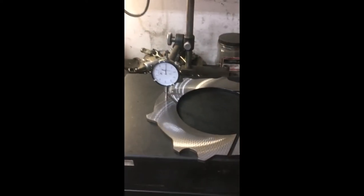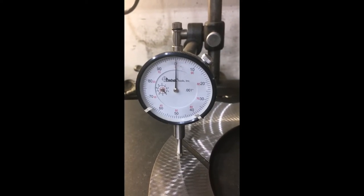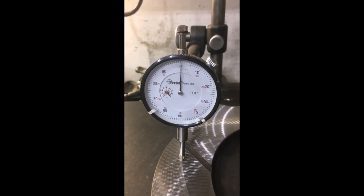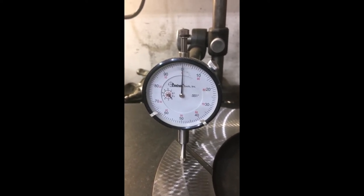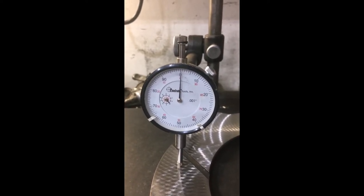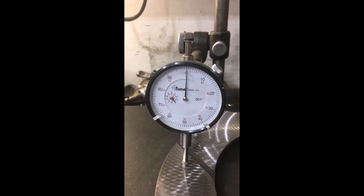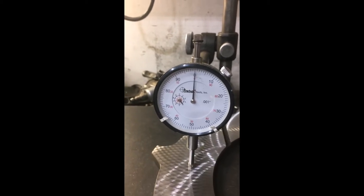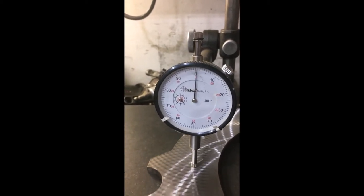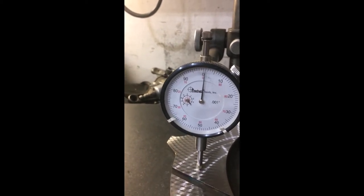Cross-hatching, I call it diamonds. Get some nice diamonds in there. And this is how I check it. I got a nice flat table with a measuring device just to check it for flatness. I gotta let you know now, I'm not a machinist. I just love anything fast and powerful, and Jay Blake has a top alcohol funny car and I'm helping him out. So alright, basically I check it by just going around, and I'm allowed to have about 2/1000ths of an inch difference, and I'll go through the whole stone,